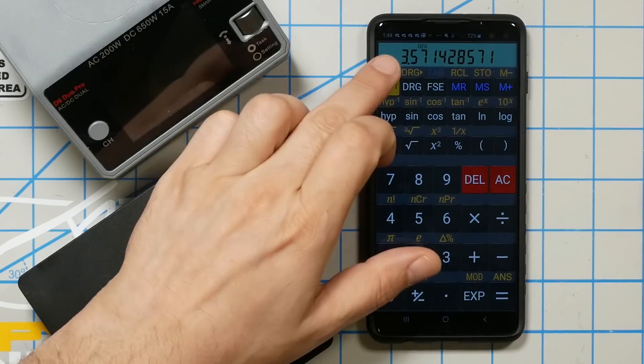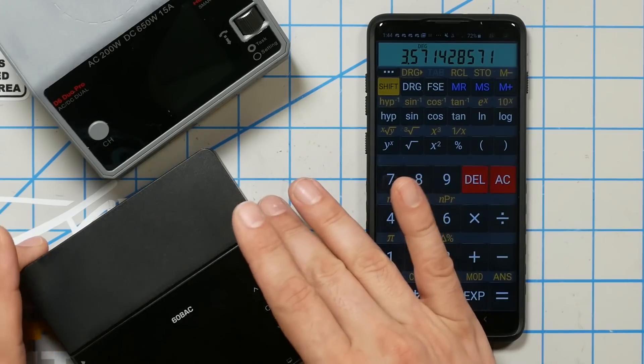So if we take 60 watts and divide by 16.8 volts, that means we could charge at a maximum of 3.5 amps. Most of the time when you're charging a 4S battery, it isn't at 16.8 volts — it starts down at 14.7 or 15.0 volts and slowly goes up. So you'll get more amps earlier in the charge cycle, and as the voltage comes up and the battery approaches full charge, the amps will slow down — which is actually what it does anyway. I use 16.8 volts to get a slightly conservative number, and anyway the goal is to compare the two chargers to each other. So assuming a 4S battery, we'll be able to get 3.5 amps off the 608AC when running off AC power.